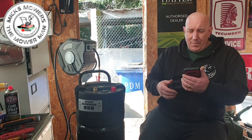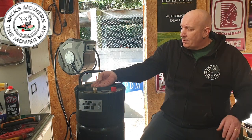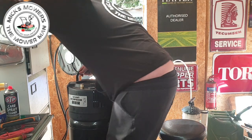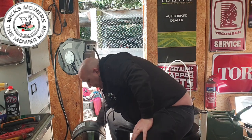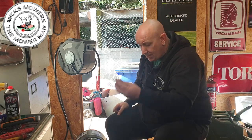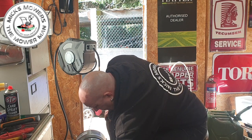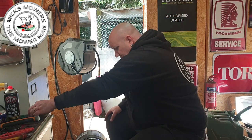Okay, so now the time is 14:40, exactly on the button. So that's had 10 minutes' running time. It's not very hot at all - that's good. So now what they say to do is to tip the machine back onto its bottom. Let me just unplug that first so I don't zap myself. Nothing silly. So tip it up onto its bum like so, and then put back in the drain plug. It's got a little tiny O-ring on there, so all I do with mine, I just nip it up sort of hand tight. And I'll just get a pair of plumber's grips which are down here.